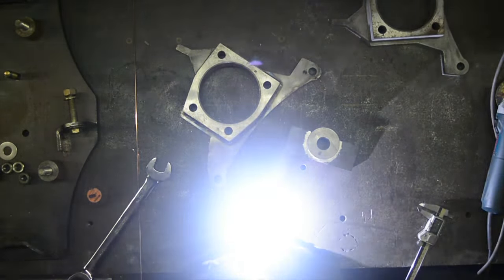If I've got a common bend that I do multiples of, I'll show you how I do that. Same idea, this is the back plate for that spindle. There's multiple bends in this one, but you can see these etched bend lines. So this gets set up in the press. And for a couple common ones, I have laser cut some little acrylic stops. So this is my 45 degree. I place this up against the face of my bend and then I bend until I touch the bottom of that. Now this is 22 and a half degrees, but that gives me a 45 degree bend. Very repeatable, simple way of not having to put a protractor on it. You just bend until that gauge touches.